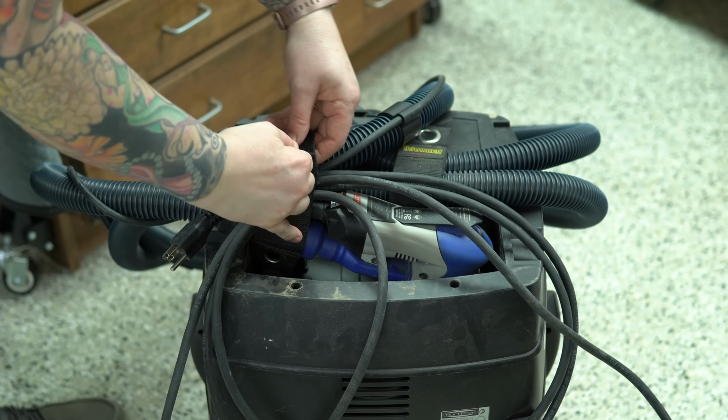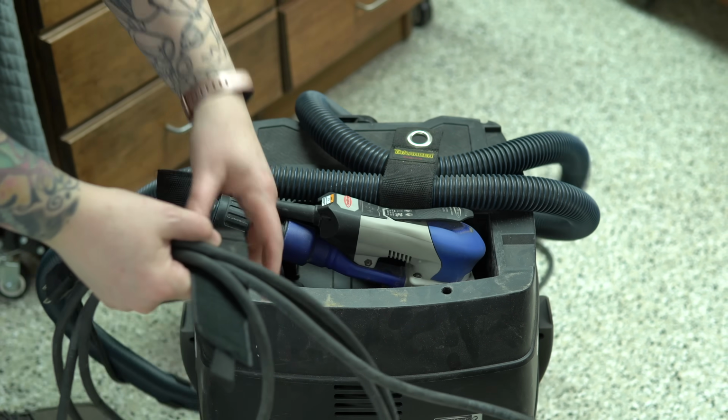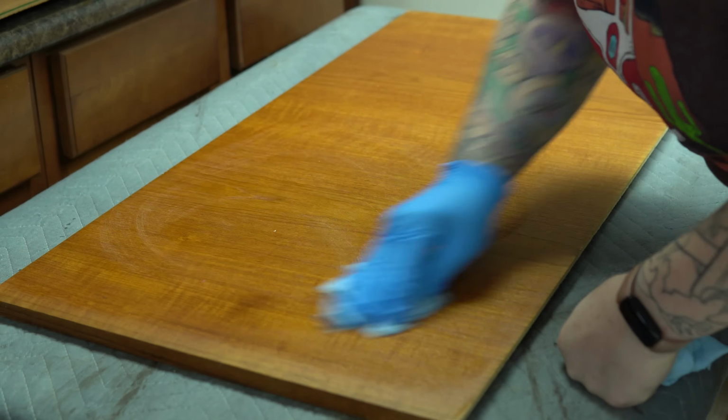These Danish pieces have different types of finishes applied. Sometimes it's a Danish oil, sometimes it's conversion varnish or some sort of lacquer. This one is definitely not conversion varnish, it's very thin. So I'm just going to clean the piece well and then sand off the old finish.